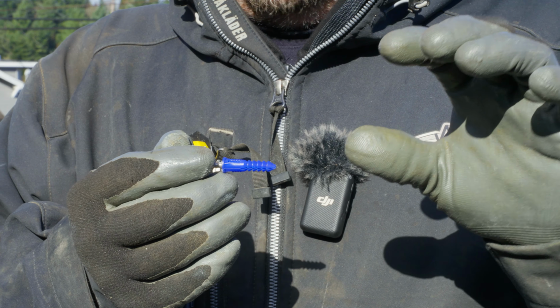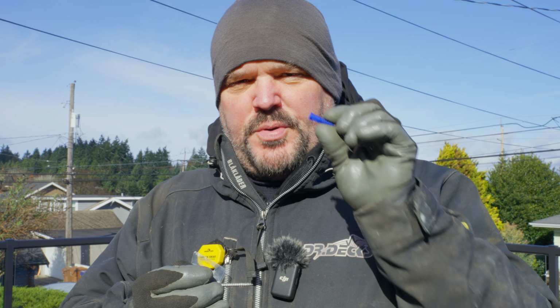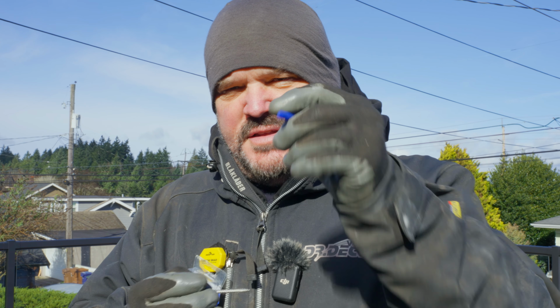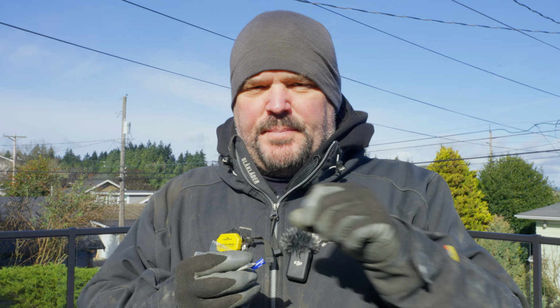We put the board up against the concrete. We drilled through the AZEK into the concrete. We pulled the AZEK off the wall. We drilled the proper size diameter hole, which is a quarter inch to fit this. We dropped these into the concrete wall. Then we went back and we put some construction adhesive / sealant on the backside of the piece of AZEK. We stuck that to the wall.